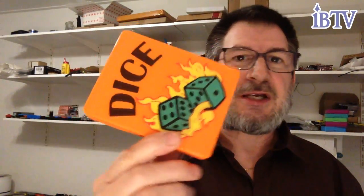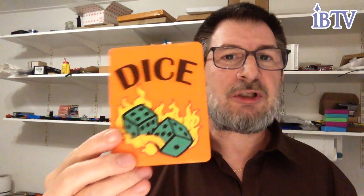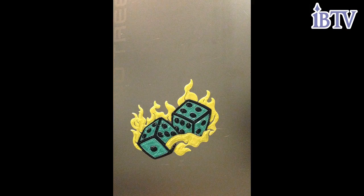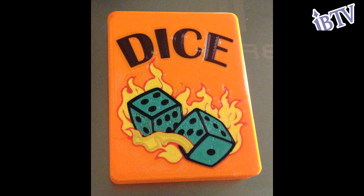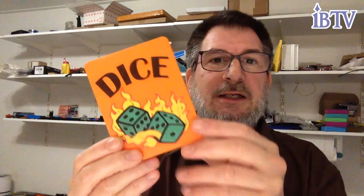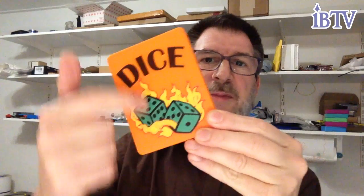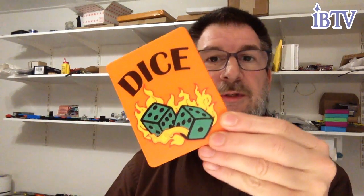What I did was use z-hop to do the face in multiple prints. With z-hop, the nozzle jumps over the resulting prints when you do a retraction. Wherever it's trying to go where there's no actual printing, the nozzle will raise up and go down. In this case I used six different colors for about 0.6 millimeters — or two layers at 0.3 — to make the initial colors.